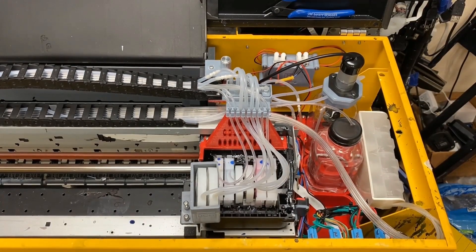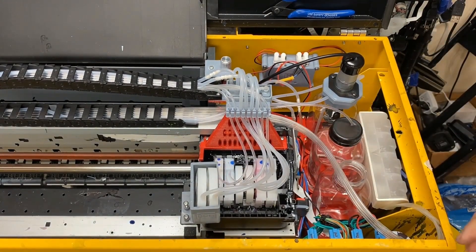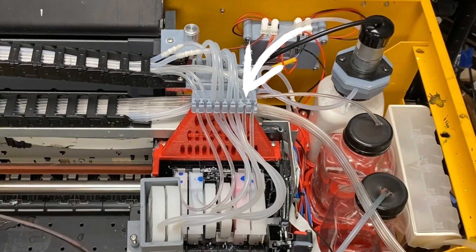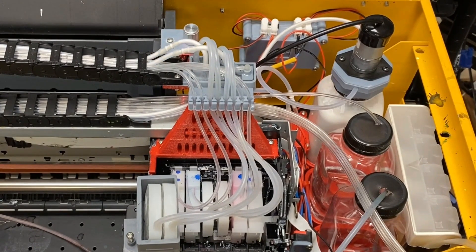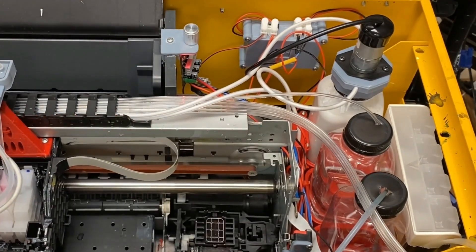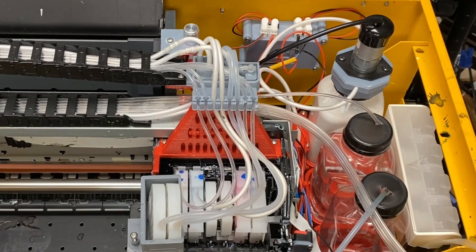You may find that I put a tray underneath — that's the organizer. So you get three bottles: white ink, maintenance, and waste tank. If we did everything correctly, when we turn the printer on you should see the white ink go through the secondary tank and then get returned to the bottle. You might notice not only does the ink fill the secondary tank, but you can also see the lines going to the damper filling up — and that's a good sign.